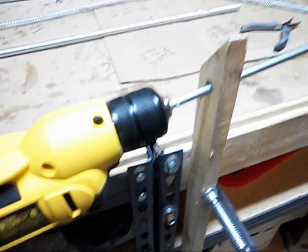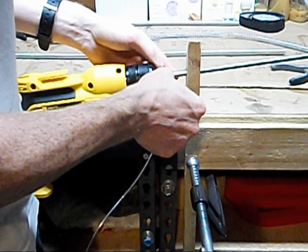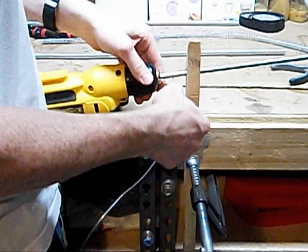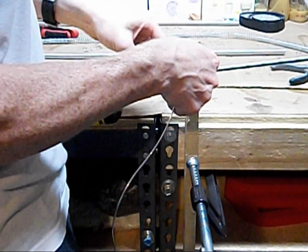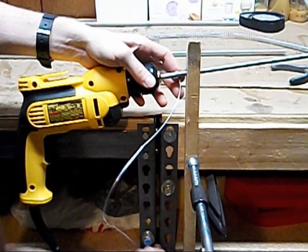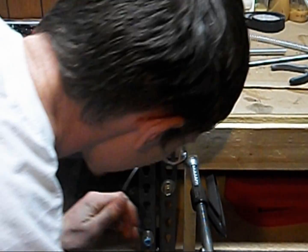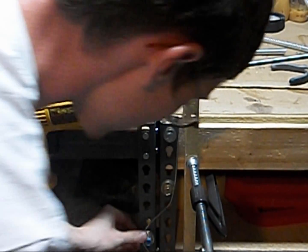Yeah, I'm gonna go ahead and feed that. Alright, I hope you can see that well enough. Just gonna pull out a little bit of wire, run it into the hole that I've made in this rod, and I'm gonna give it a little bit of spacing at the front there so that I can actually cut it away when I'm done, and just do the first few coils by hand to get it on there, and then run it through the tensioning system like so, and we're ready to run.